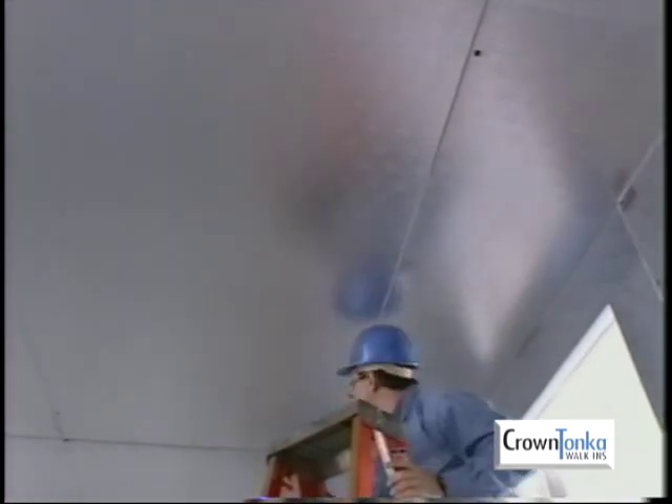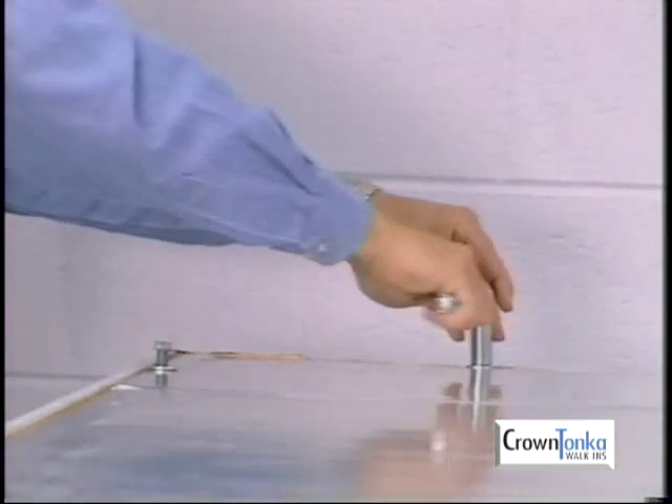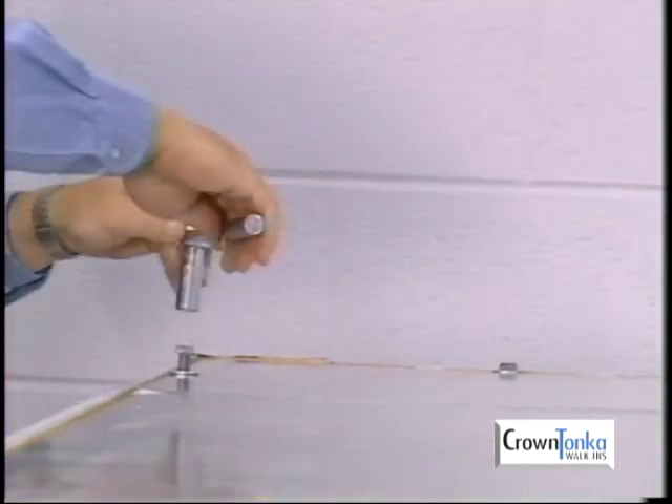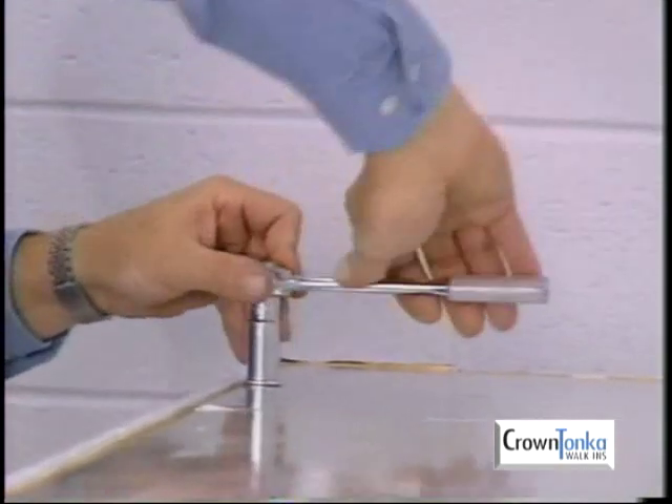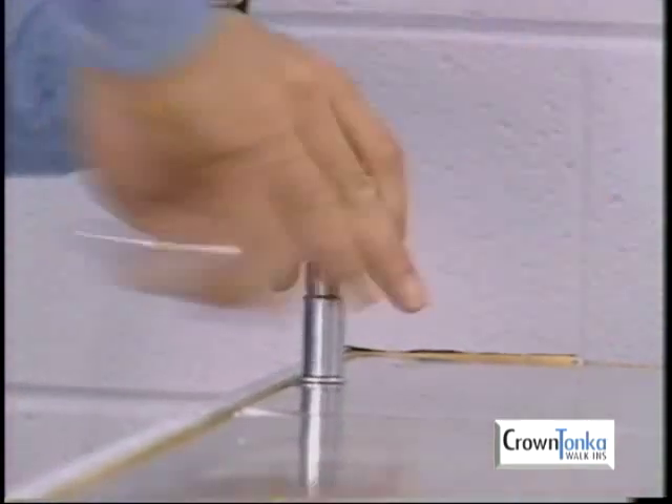The last two panels must be put in together. To maintain the 3/8-inch spacing between the ceiling panels and the wall fascia, slide a loose lag bolt into position after every three ceiling panels at position 5. After placing and cam locking all of the ceiling panels together, install lag bolts in the ceiling sides and ends. Start with the first panel and work your way across the ceiling.